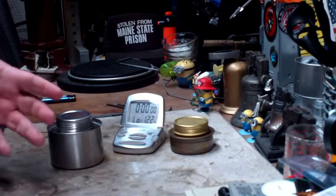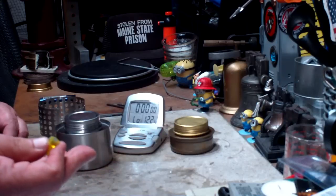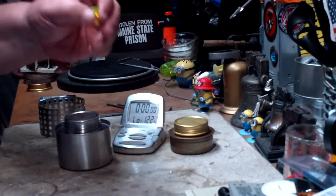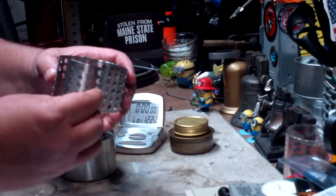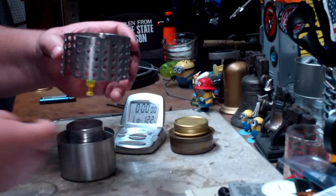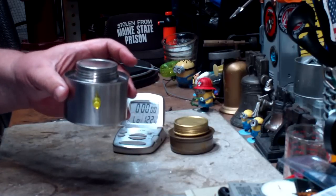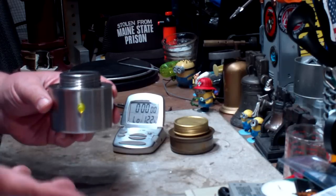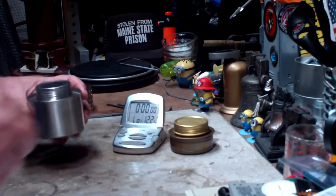Both series are good — it depends on what you want them for. Some people do the magnet test on tableware and cook pots; you don't want a magnet to stick to those because they typically use 300 series for that. On this pot stand, the magnet does stick — just barely — so that tells me it must be 400 series. It also sticks on the side of the burner, so either this is 400 series too, or there's a metal liner on the inside.